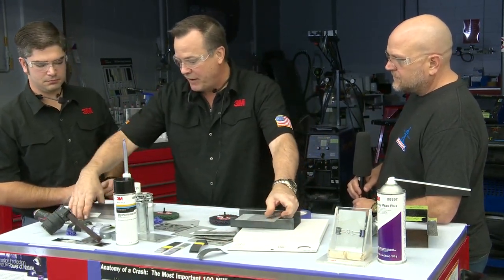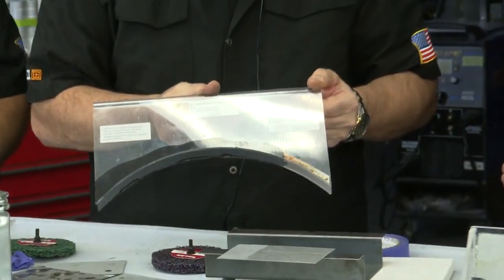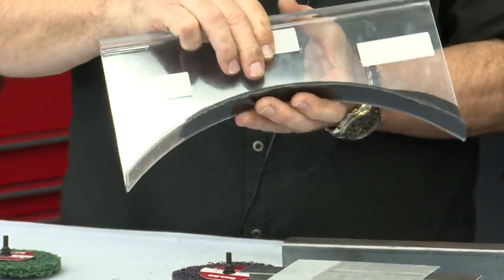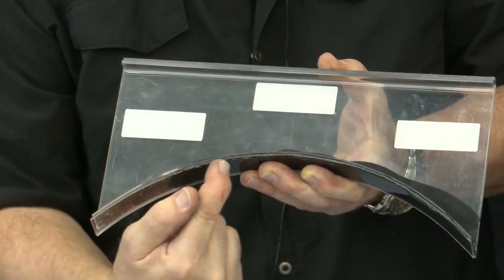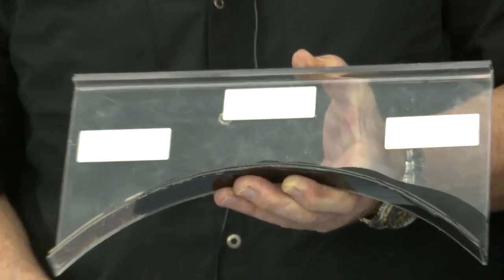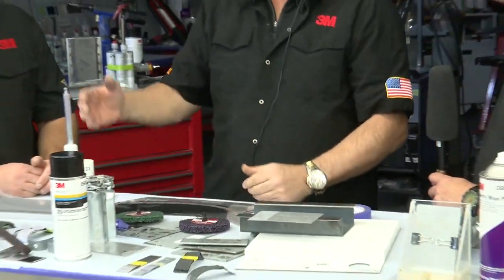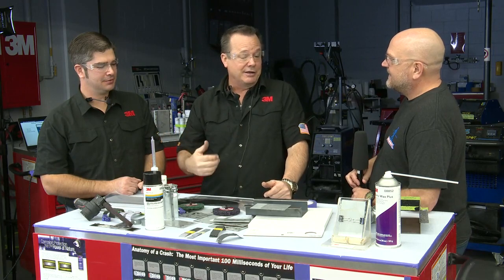As a matter of fact, here's a great example. These are two panels that are bonded together, and once we squeeze these together, you can see the squeeze out coming out of that area right here, okay? So it's always 3 applications of adhesive, which, by the way, is why we have a pneumatic applicator, because if you're doing a large van roof or something of that nature, to go 3 times around that is pretty hard to do with a manual applicator, no doubt.